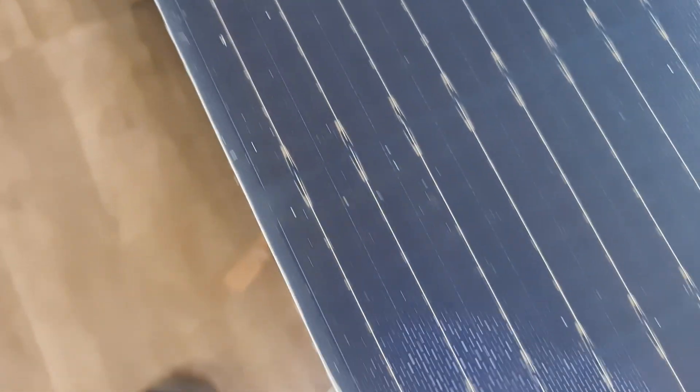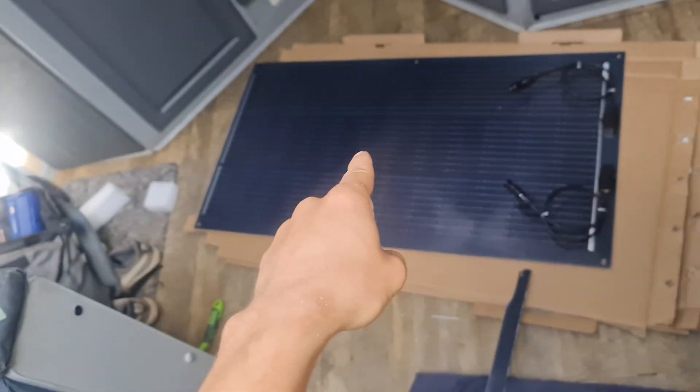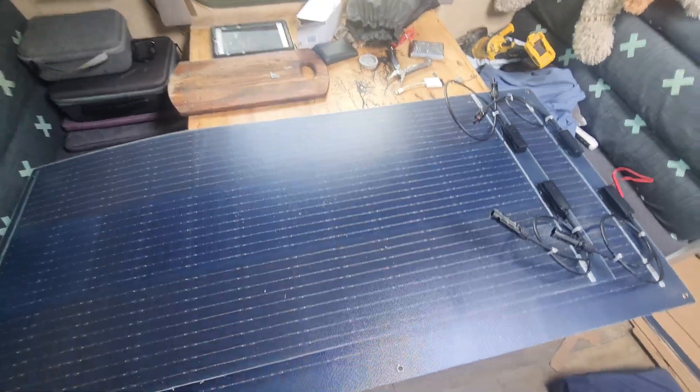You can see the cut — it's totally enough. It's cutting it pretty close but I didn't nick the panel at all, and I tested it and it puts out perfect voltage, exactly the same as the uncut one. So I'm going to assume it's undamaged and cut the other side. Second trim done and they're still putting out the exact same voltage.